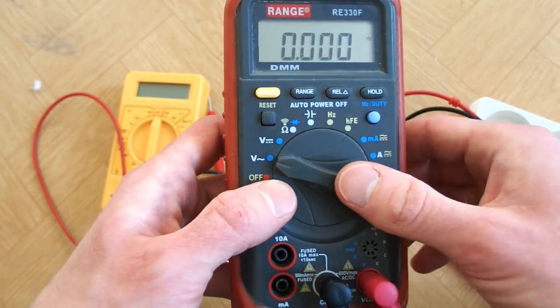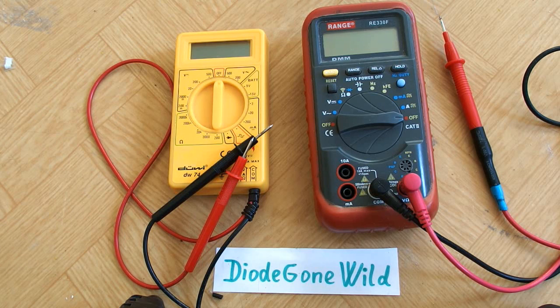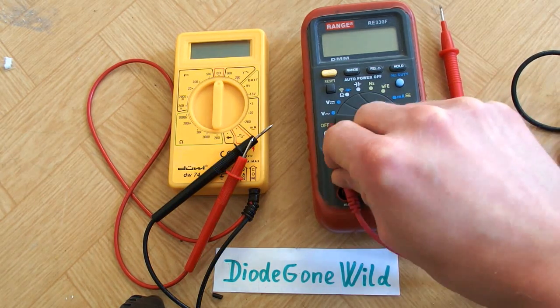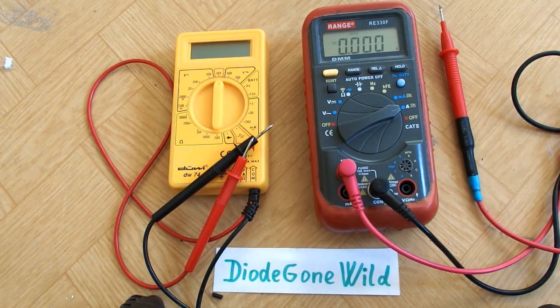The manual tells nothing about this. But my worst multimeter experience — and honestly almost a deadly one — is just coming. Two months ago I was trying to measure the current of a heater element. It was running at 230 volts and drawing almost 10 amps. I took my multimeter, set it to the amps port, turned it on, and tried to measure it.